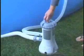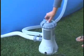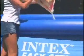Remove the hat-like plugs so water can flow into the system. Follow the filter pump manual to release air trapped in the hoses. The Intex model 22R pumps have air release valves on top. You are now ready to add salt to the pool.